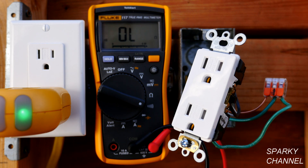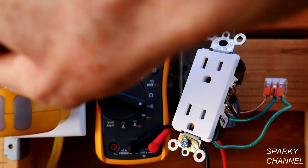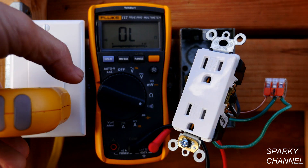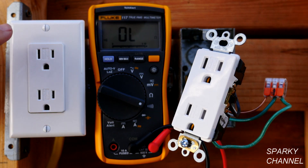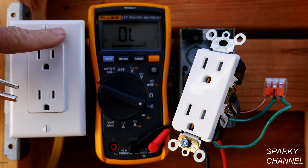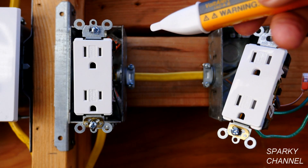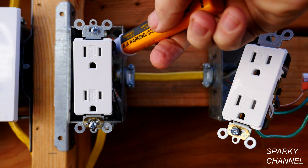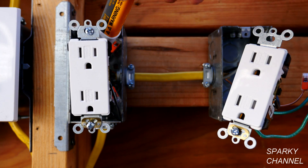Now I'm going to turn the circuit breaker off. I've turned it back off and the outlet detector confirms there's no electricity in the box. My voltage detector also agrees the circuit breaker is off. So now I'm going to take off the wall plate and remove this upstream receptacle — we're especially going to be looking for the neutral connection that brings the neutral wire over to the end-of-run box. I'll use my voltage detector as a double check to make sure there is no hot wire at all in this box.